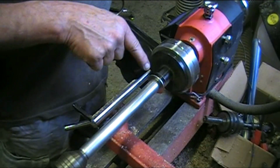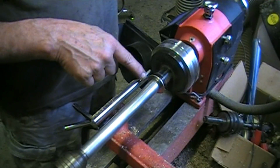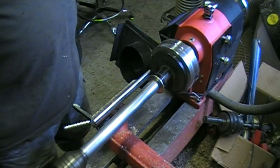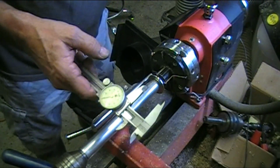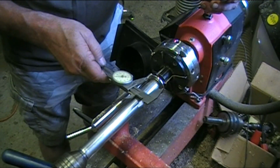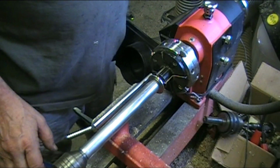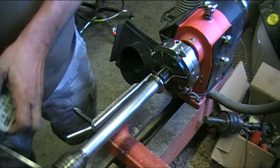I mean, this is wiggling, but this is pretty smooth. So I should take a carbide bit, cut about just a little over 1/8 of an inch off the diameter, and I'll be good. I love it. So let me get set up. Alright, so I measured the inside, and it looks like I got to take a good 1/8 of an inch off. So let's see what that looks like in real life. I may have to go with plan B, but let's give it a shot.